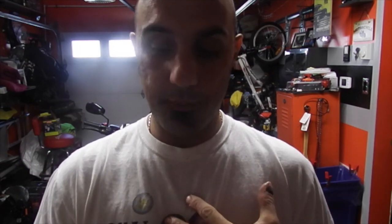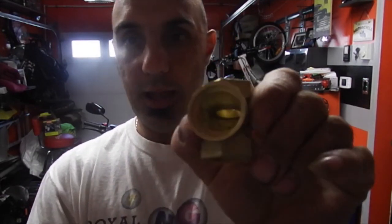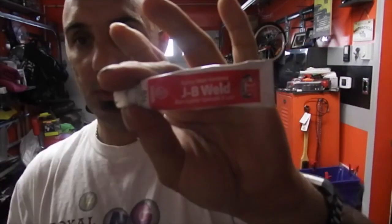Once that is done, you're gonna have to pass 2 other wires in here. So for the light bulb or the power switch, what I could recommend is, once this piece, the switch, is glued to its place, you're gonna have an opening. It will be much easier to pass the wires here first before you install this. Once you install this, use the same glue. Look, I didn't show you what glue I use. JB Weld. It's 2 glues, resin and a hardener. Mix it together, stick it, and it holds great. I recommend you wait at least 8 hours before handling it.